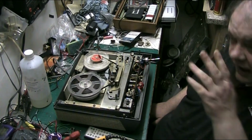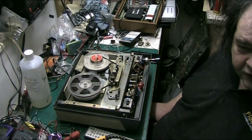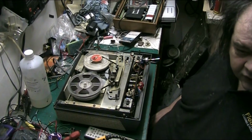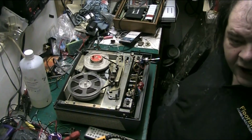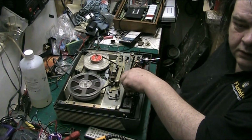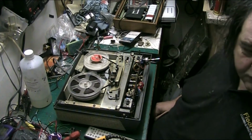One lad said it could be something to do with the head not disengaging. Well, you were wrong. Steve, the Oracle, he said it. Steve at UK405 said it could be C16 or C7, but I've already spoke to him, and I'm afraid he was wrong. I said it was the ECC83, and unfortunately, guys, I was right. It's probably been centred on the way. There's no feedback now, and all I've done is replace the ECC83 with a replacement, and it's gone.